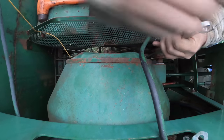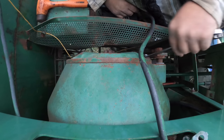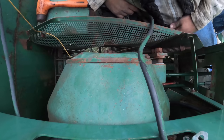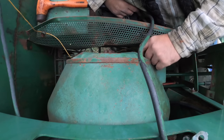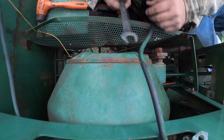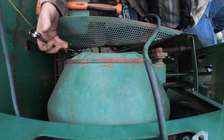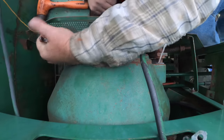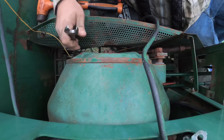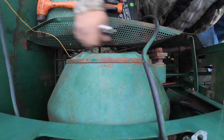Another fun fact I was thinking about was I tried to buy this combine on several occasions. I knew where it was. I saw it at that national show, and I knew it was in pretty good cosmetic shape. It needed some maintenance, it looked like, which it still does. When I was running those other two, the 545 was always the corn combine. It's got all kinds of special corn attachments in it, like on the walkers. And the red one was set up for beans. When I saw this one, it was a 7300, same as the red one, just older. And I had a four row corn head that'll fit right on here. I could put that bean head on if I had to. I've actually got a rigid grain table that would fit right on it.